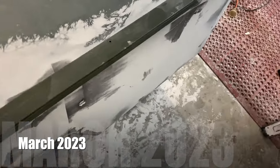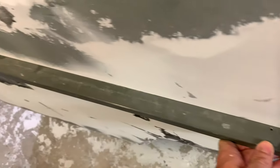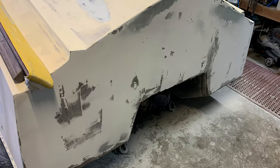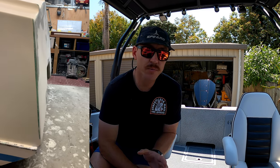Now the fairing of the transom — like you saw earlier, I did have a few issues getting it nice and flat. I did build it up a lot with glass and got it pretty close, but it still needed a fair bit of fairing to make it all smick. The process for me was just cover the whole thing with fairing compound, make up a big longboard, sand it flat, fair, sand it flat, fair — and I did that at least six, seven, maybe even eight times before I got it to the point where I thought it was ready for gel coat. The end result was quite a thin amount of fairing which is what I wanted — super flat, dead flat. It came up really, really good. I was stoked with that.